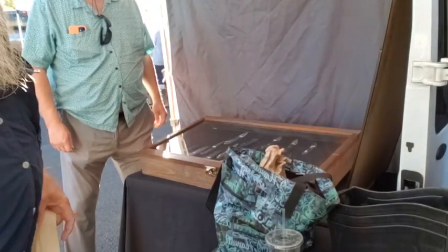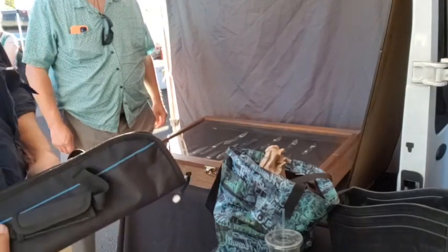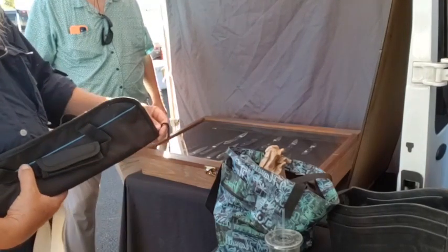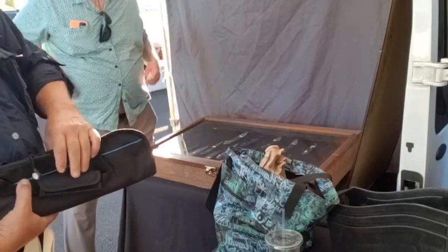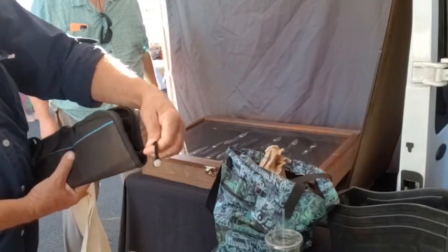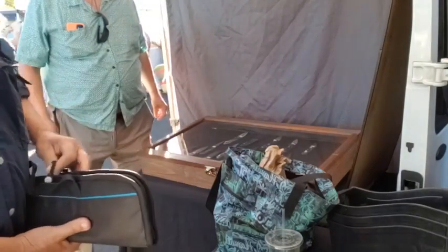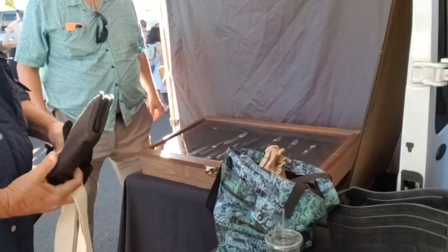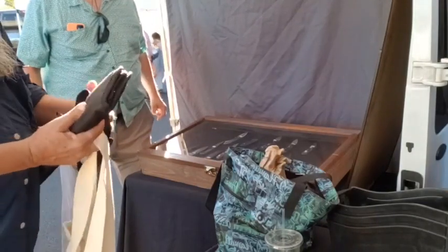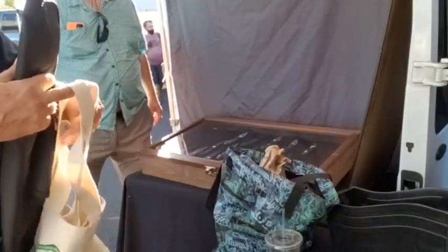I just did a video on what steeling does to a knife, because there's a lot of talk about the wire edge straightening the edge. If a knife is sharpened, there shouldn't be a wire on top. And when you use a steel, not a ceramic honing rod, but a steel, it actually scrapes the metal and makes just a loose wire piece on top. Well, I'm going back to my ceramic.